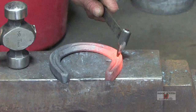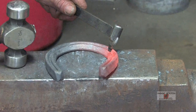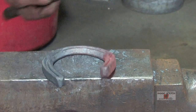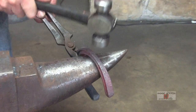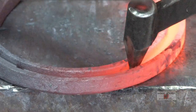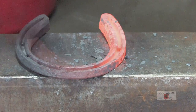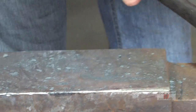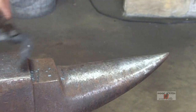The widest part of the foot — even a little bit farther forward — because a wedged heel shoe would have the bridge farther forward. You'd have to cut a little bit more of the heel off to make the wedge go on. Any kind of Arab toe weight, any kind of shoe meant to have a wedge or a build-up in the back is definitely going to have the bridge farther forward. Run that back edge ever so slightly. We've already got our toe nail set up. On the outside edge, skip over right about here and pick it up right about here again to make the wedge. If you hit the top edge it just collapses, so to get your flow and to get the frog eyes out, hit that edge that's connected to the opposing side.